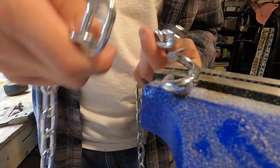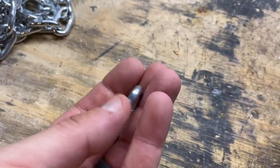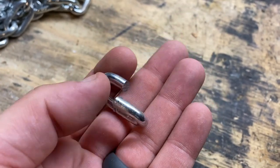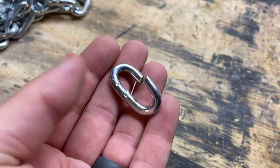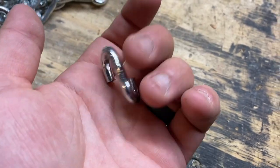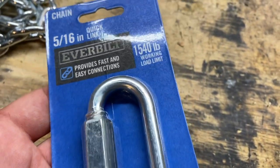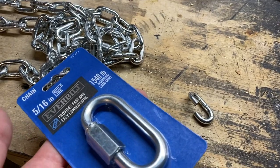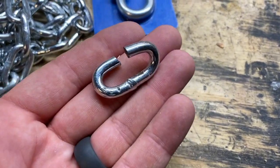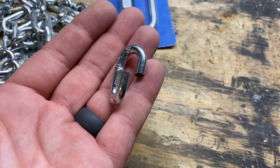There you go — that's the link you cut, and your chain is separated into two pieces. Now, it's possible to bend this back and attach it to the chain if you wanted to, but it might break and there are some sharp edges. For the most strength, I wouldn't use this — I would use something like this to connect it. This is overkill at 1,540 pounds working limit; the chain is only maybe 600. I would definitely use a proper connector instead, because you could potentially bend and break the modified link off the chain.